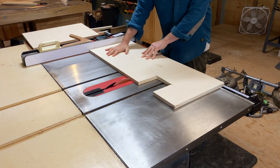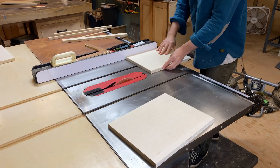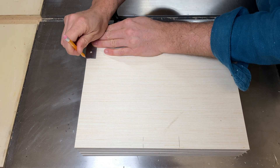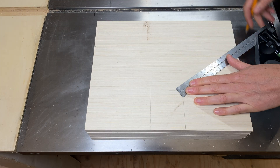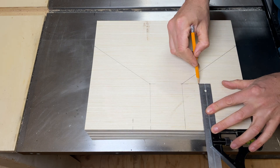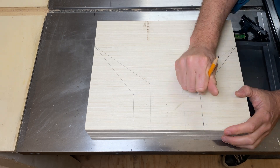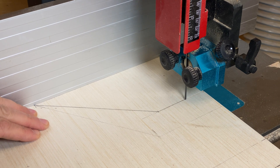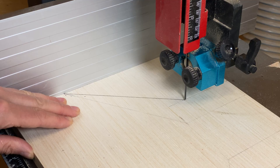I'll start by cutting up some plywood for those front and back octagons — I'm going to need four of these, two for the box on the wall and two for the box that goes up and down. I'll draw out the shape I'm going to cut. During this process I realized it's too narrow at the bottom, so if I wanted to have a handle in there I'd have to make it a little wider. I just fixed it on the fly. Then I cut them all out on the bandsaw, doing stop cuts for the narrow parts on the bottom and the diagonal parts freehand.